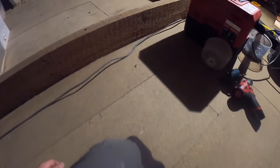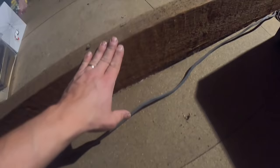Right, this is that switch that does the bedroom light. You can see the light coming through, lovingly clipped by the previous sparks that rewired the lighting, by the looks of it. Anyway, that's good for us. We can pull that out, pull him down here. Look, there's the first one I've just drilled up through into that bedroom. This is that beam I was on about, and that's the floor joist I was on about. So we've come across and away from that beam. So we'll have one there, and then the other one is there.